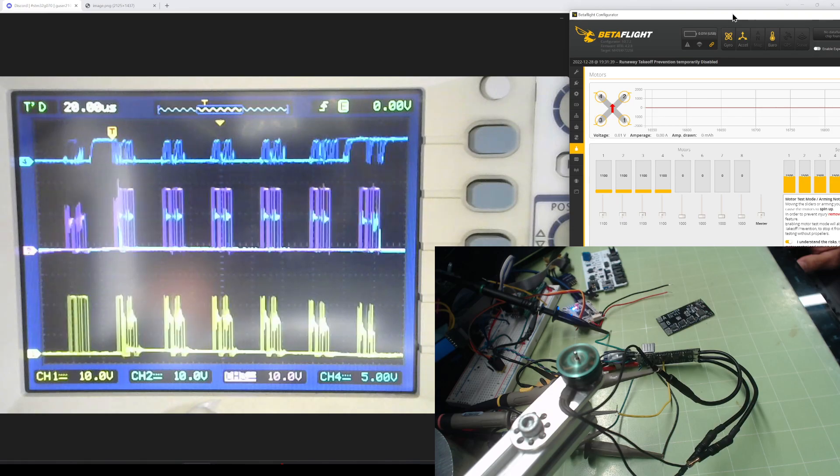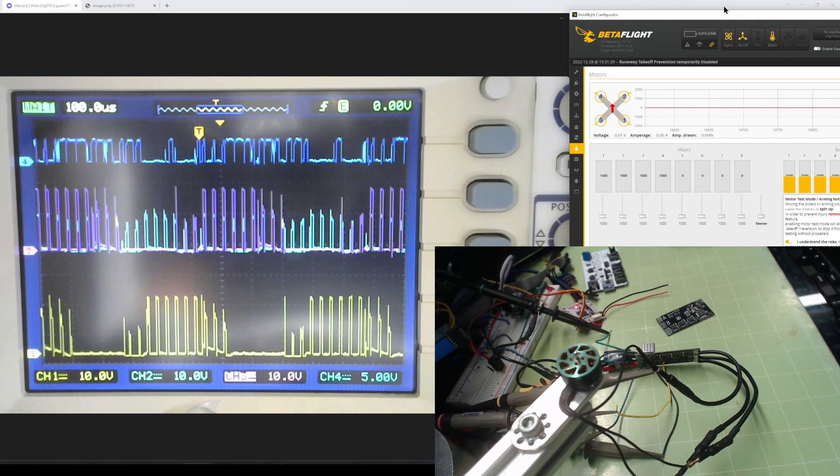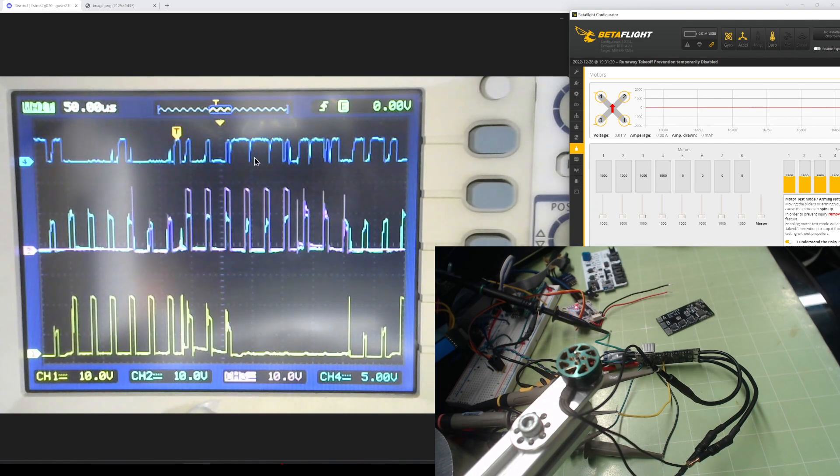Let's make it a little more complicated. So that's about less than a quarter duty cycle. You can see this would be difficult to detect because of this here. The rising edge is still easy — you still have to detect for a specified period, which is also dynamic, but it's shorter than the one for falling. The rising is more critical than falling, and it's also the easier to detect. This is the problem: the duty cycle is small, so the gaps are bigger and more frequent. The duty cycle remains the same, but there are more PWM periods before it crosses the virtual ground.